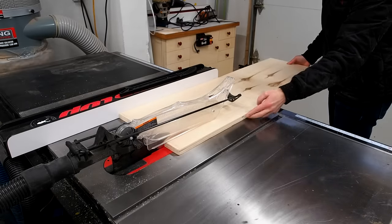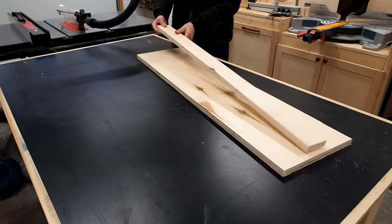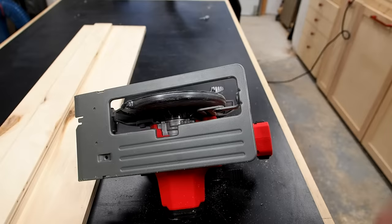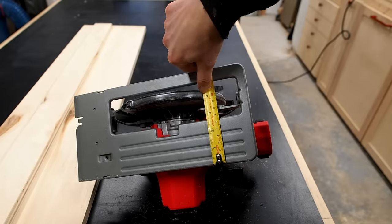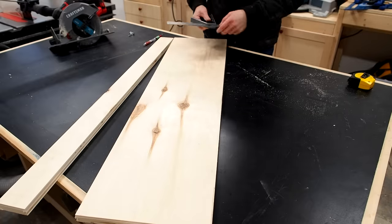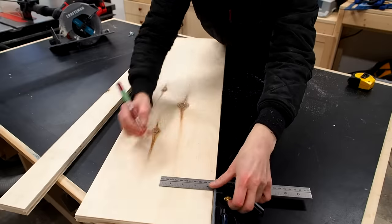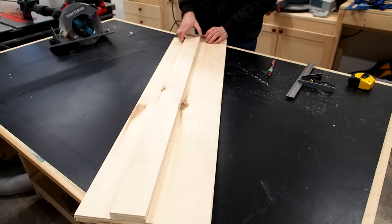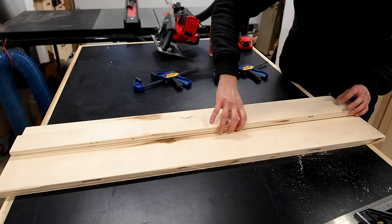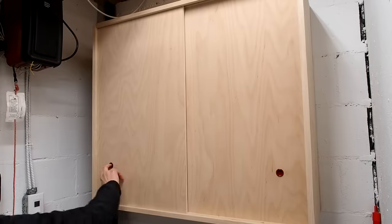You can make it any length you want according to your needs, but I find the three to four foot length to be ideal. You'll want one strip roughly ten inches wide and the other about two to three inches wide. Next grab your saw and flip it over to get a rough measurement of the distance between the edge of the base plate and the blade — it doesn't have to be exact, just a rough idea. Then add a half inch or so to that measurement and mark that onto the bigger board, making sure the reference edge is the side that the saw blade will be on depending if your saw is blade right or blade left. Add a little glue and clamp the other piece down right up against the line, then grab some flat head screws and screw it down after first making some countersink pilot holes.